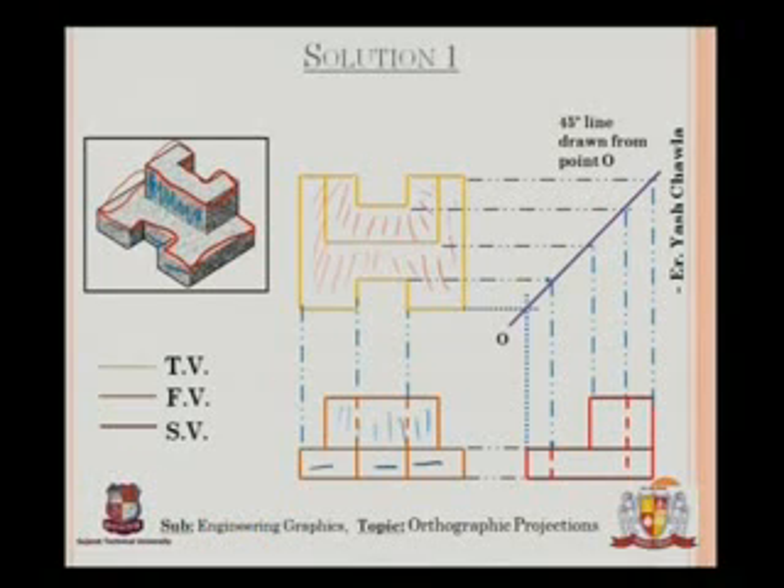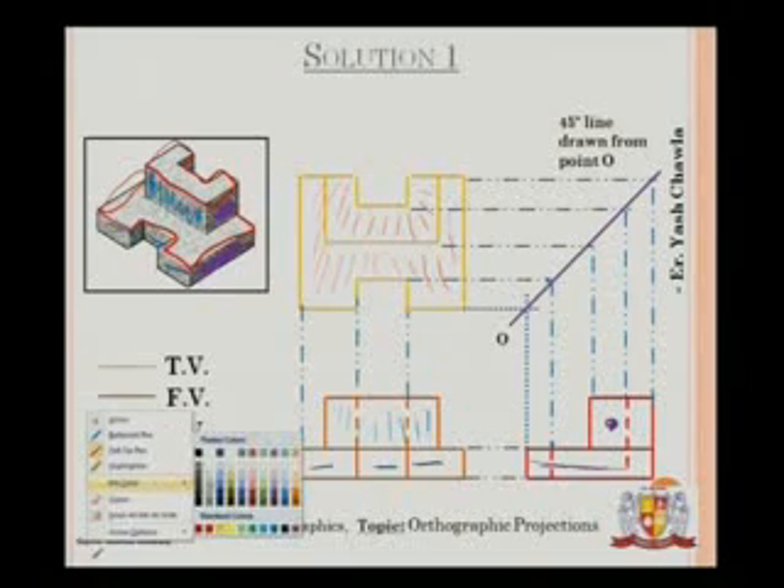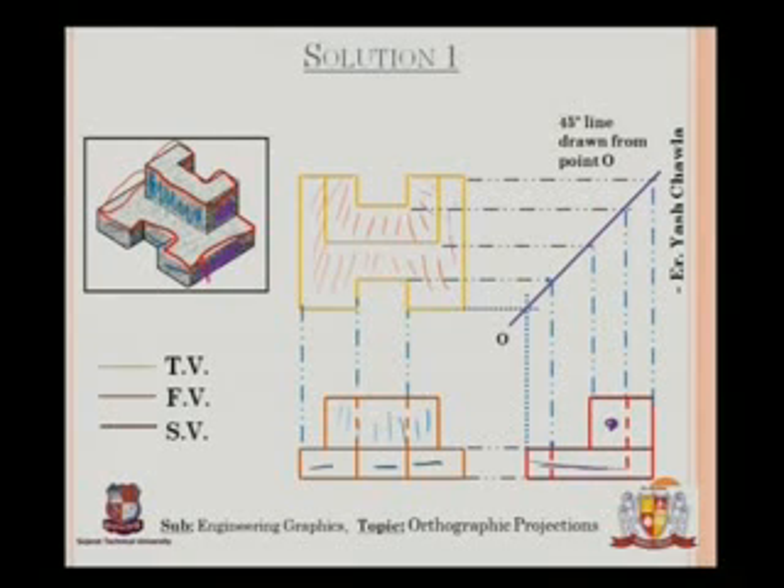When I move on to the side view, I am seeing this part. There will be a dotted line here and a dotted line here — these are invisible surfaces. These dotted lines in blue represent a 45-degree line which is drawn. As we draw projectors, all these points have to be projected, so this point comes and lands here. That is why if I mark a point as A, I know this point is A. If I mark this point as B, then B exists here also and B exists here also.